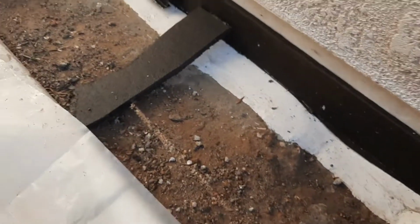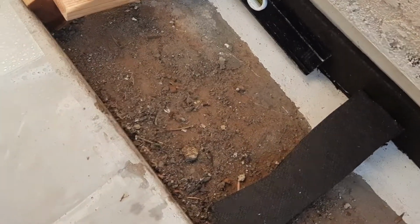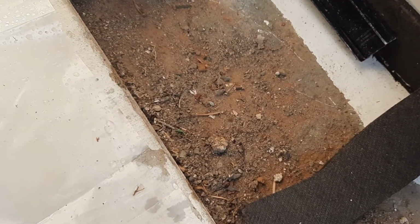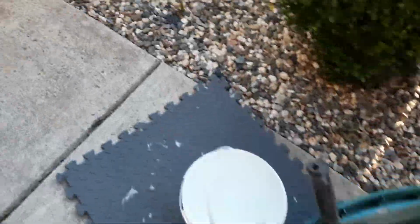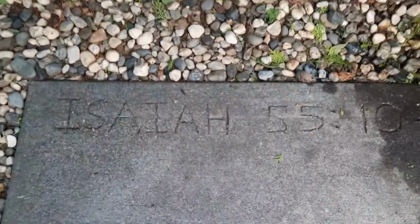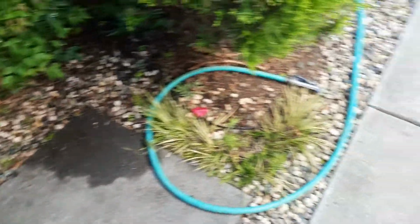All right, we have the area wetted down and ready to go. We're going to be pouring on partial clay and partial footing. So this clay has been compacted and is not going to be moving anywhere. So we don't need rocks. We got our water measured, our 3 containers, and just for reference, here's a concrete pad we poured about 15 years ago. It's a little shower pad out in the backyard, and so that's held up really nicely. It was broomed, double broomed to give extra grip. So let's get started.